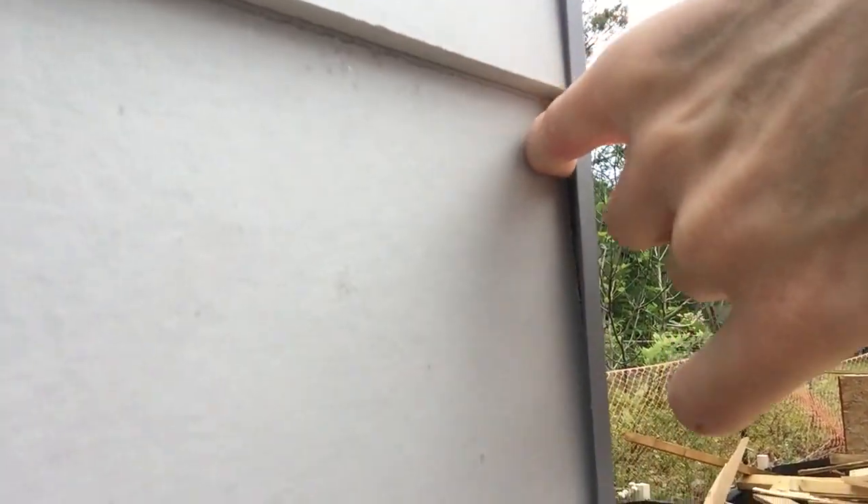At the corners here, a couple of these are cut a little bit short, and this is our mock-up wall we're looking at now. This gives us an opportunity to make these kinds of cuts and then go back and adjust — say, in the future we want them to look more like this. By pushing this right up against the edge, that minimizes the gap there. We can allow moisture into this wall — any kind of bulk water can get into this cavity behind this siding, whether through the gap at the edge or anywhere else.